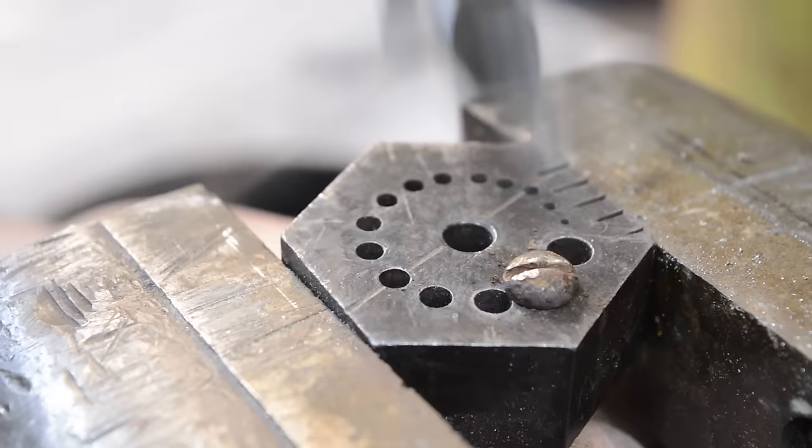Some of you may notice that the color's a little mismatched. I'll drive that in. There's another month's worth of work to do on this gun in terms of finishes and waxes and all that stuff. But we got the big part across, was a nice tight rust blue. We didn't mess with polish. We just left the thing the way it was. We didn't take the existing bluing off the gun. We just caught up the areas where it had been worn off.